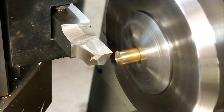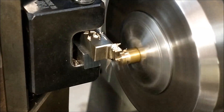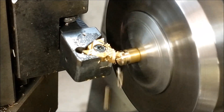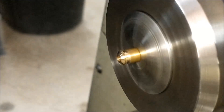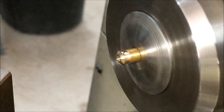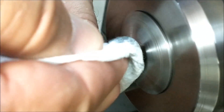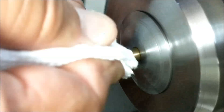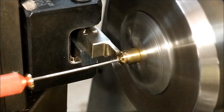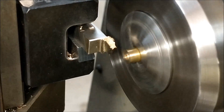You've also heard me preach in the past: knowing the relationship between your primary facing tool and your parting tool is very important. I just came in and that is the final thickness of the part. For cosmetic reasons, I establish the thickness before I put the chamfer on. That way I can control the chamfer to split the part in half. Bulletproof and very efficient process. Come back in with the parting tool set to the same initial plunge, cut it off. This piece is also done.